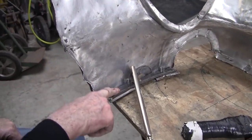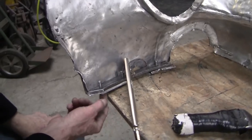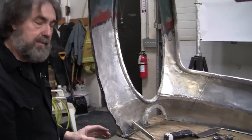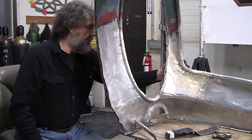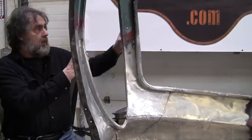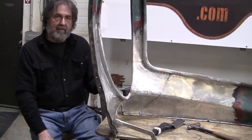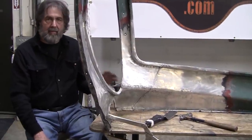We got this fit in. This is the little reinforcer bracket that Mark had made. We made it off of this side and we got that tweaked and aligned around in the original holes. We still got the gauge that Eric made over here and that's got to be all tweaked. So we got a little bit of moving still to happen. Plus this has to tweak here too where the hood is askew a little bit — that's because this has to go this way a little. So we would have to do some kind of pull operation where we just kind of diagonally pull, bringing this edge down, and then massaging this. And finally we'll get to the point where we do all the planishing, grind all the welds, planish it out, and then at that point we'll be very close.